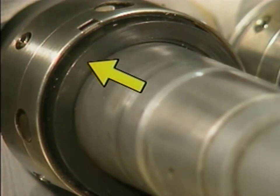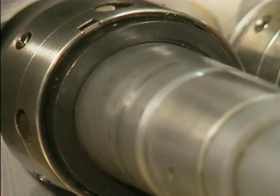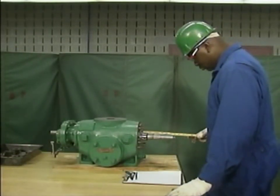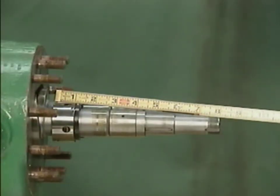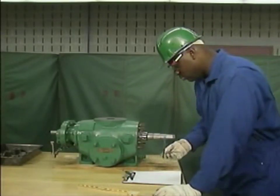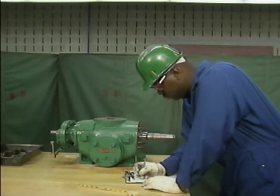This surface is highly susceptible to damage from moisture and dirt, and etching caused by acids in human skin. So the mechanic must avoid touching the carbon sealing face directly with his hands. The mechanic measures the distance from each mechanical seal to the end of its shaft. He will need these measurements to ensure that the mechanical seal is positioned correctly when he reassembles the pump. If a mechanical seal isn't positioned correctly, the seal may not operate properly.